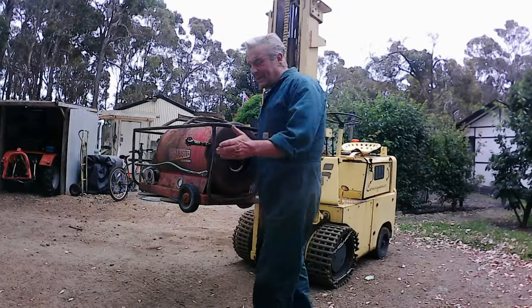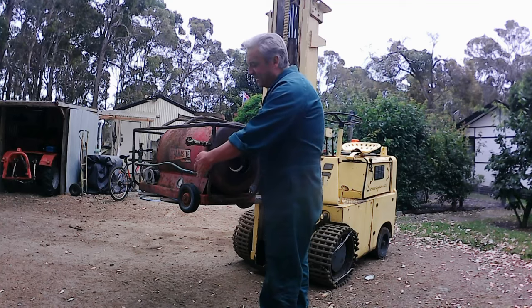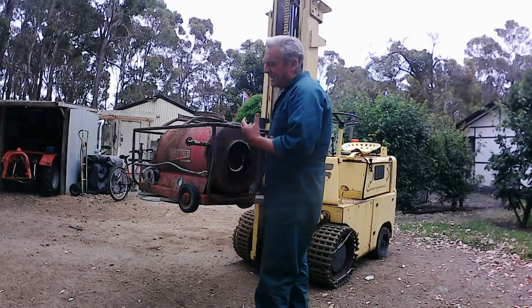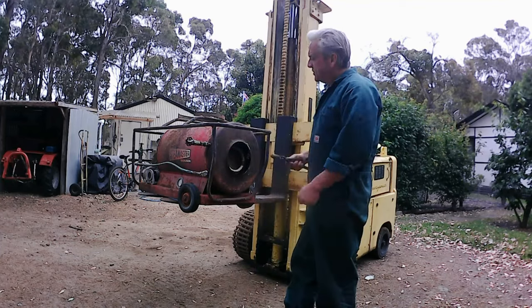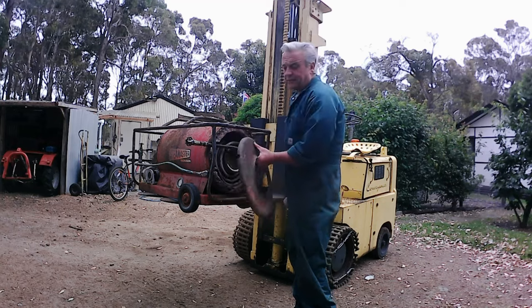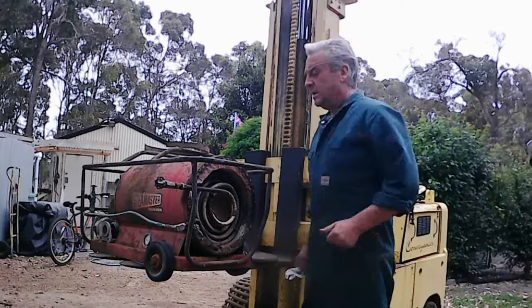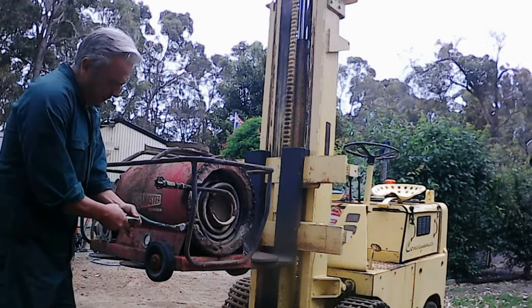So I've already connected some water to this, and it is pretty blocked up. There's barely a dribble of water coming out of this coil. So we need to take this coil out, clean out the boiler chamber, and clean out the tube. I've already taken out four little screws which hold the back cover on. Forgot to disconnect this pipe.